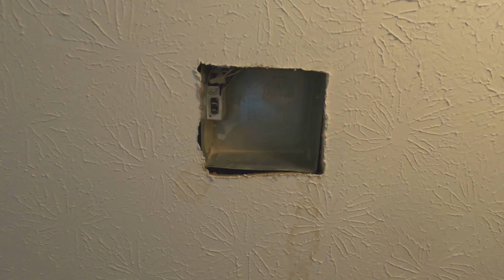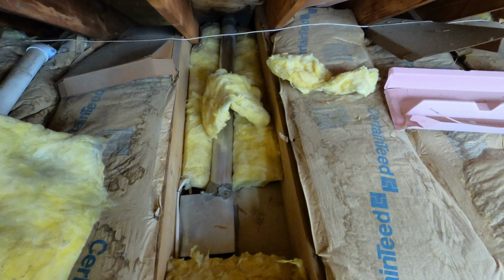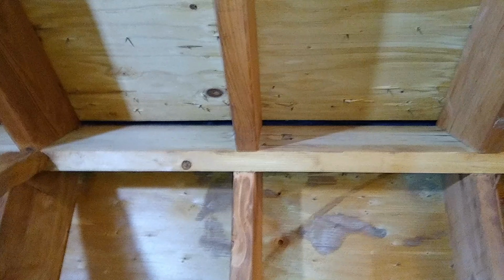I need to fix a bathroom vent that's improperly installed, so it's pumping warm, moist air into the attic. Look at this mess. Most of us know the craft paper on the insulation isn't supposed to be facing up like that. But this gets even weirder. There's actually craft paper on the bottom of this insulation as well. After my improvements are proven to dry the attic, I might just strip off this top layer of paper. I'll make that decision before putting the permanent subfloor down.